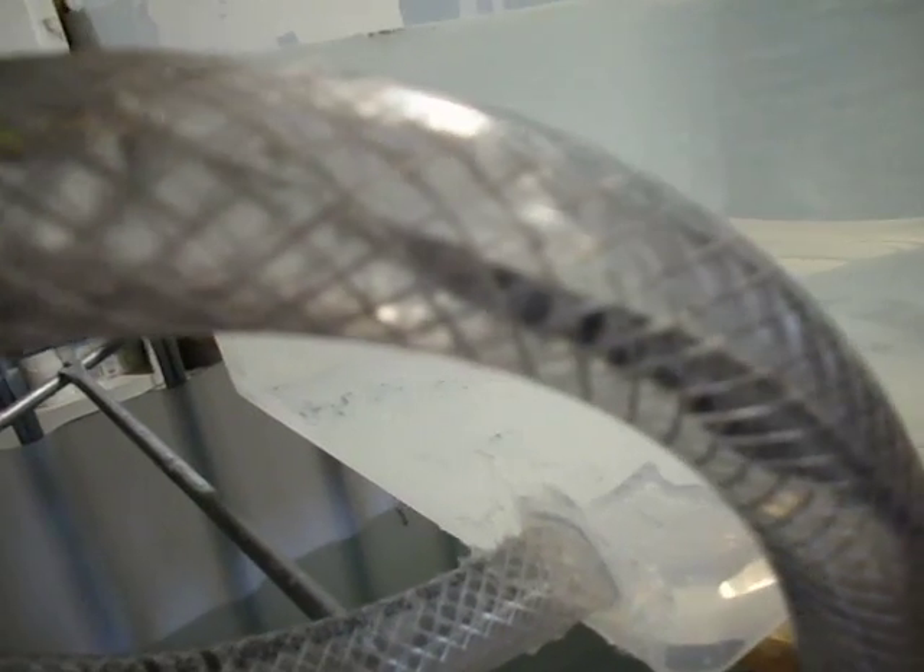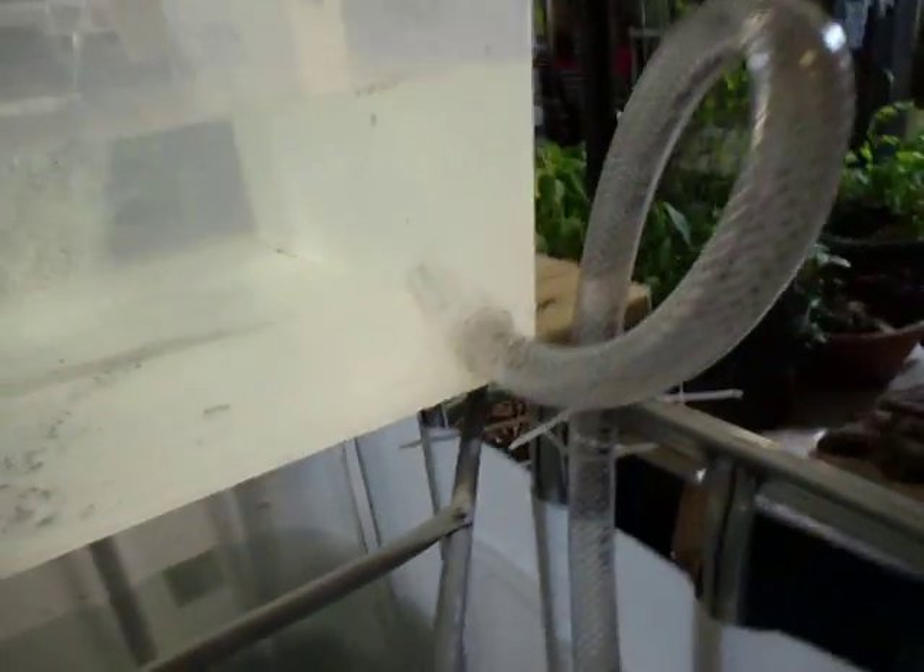While the flow is picking up, you can see the little air pocket here. This is getting ready to go over — there it goes. Here comes the flow. Now we have a really good siphon going, and that's going to drain down to a point just above the bottom. In about a minute, you'll hear a little gasping of air, and then the siphoning process will stop.